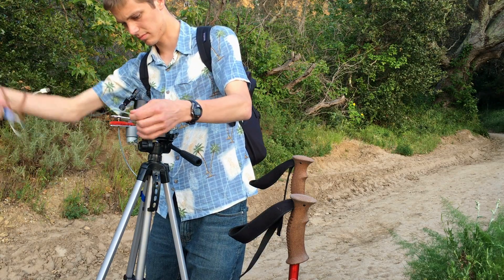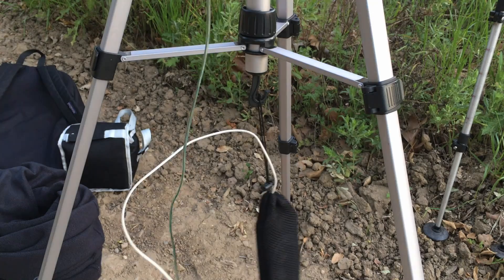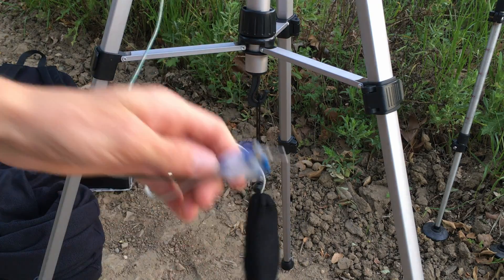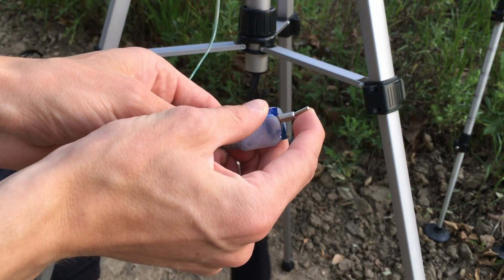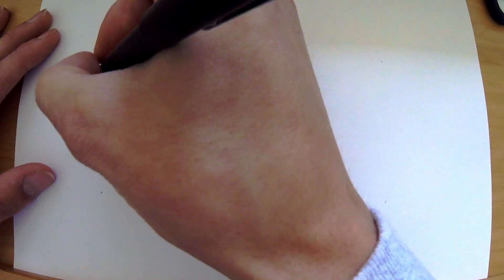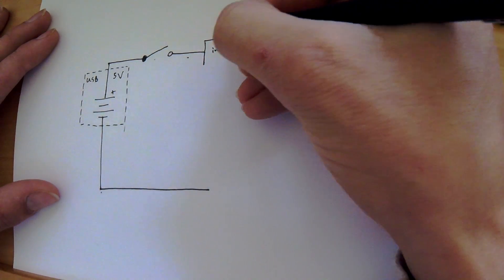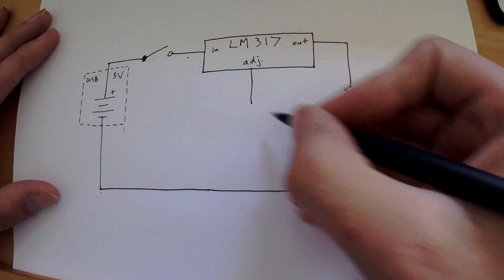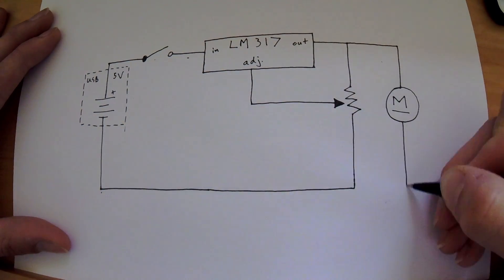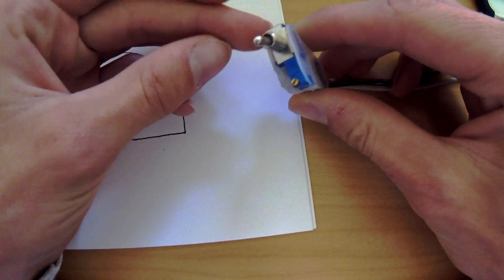I run the motor off an external USB battery pack — something I normally carry around for backpacking to recharge my phone and camera — so I figured I'd make the barn door tracker power from 5-volt USB and not need to lug around another battery. This device needs to move the camera at a very specific speed, so the power to the motor needs to be regulated. I used an LM317 in voltage source mode to accomplish this, cutting down the 5-volt USB supply to somewhere around 2.5 volts, adjustable with a multi-turn 1 kilo-ohm trim pot.